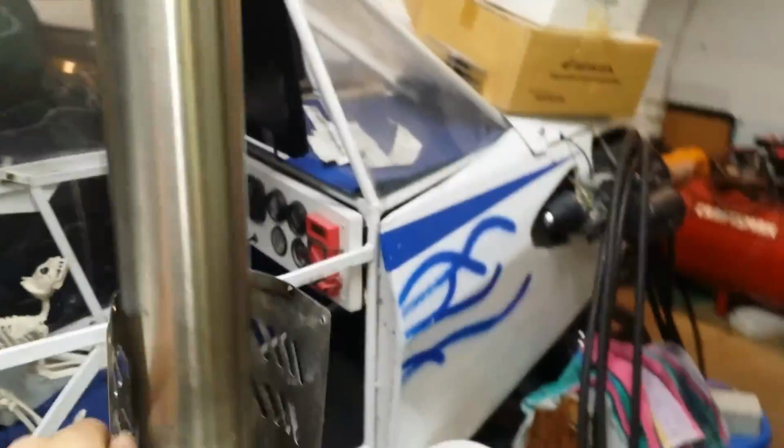First of all, you got to pull this cover off over here to access everything, okay? Now, up over in here, you're going to see this is the thermocouple, okay? That's the thermocouple. Here's a main igniter wire, and here is the tube that gives you propane. So you follow this wire down, okay? The thermocouple wire, and it comes over to this tilt switch, okay?